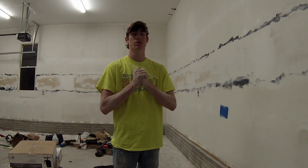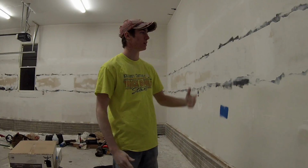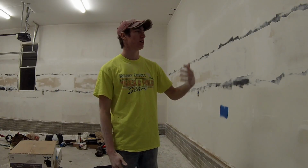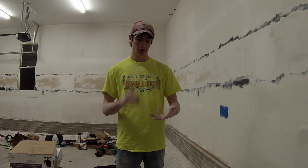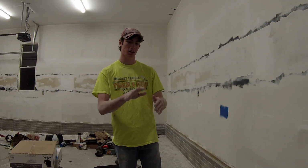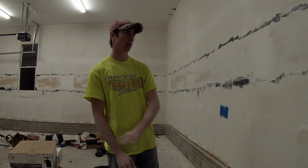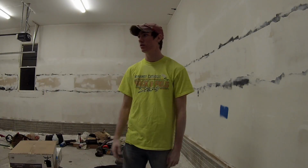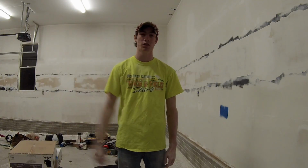So I didn't really want this video to be all about redoing it, because basically all I did was peel off as much as I could, and I didn't even need to do that. But basically, if this happens to you, I talked to 3 different people from Sherwin-Williams, Builders, and Menards, and they all said that you just sand the edges of the paint where there's a ridge. You sand that down as smooth as you can, and you come over with joint compound, go over all the cracks. So obviously I used a ton of joint compound. I had to buy another 3.5 gallon thing of it, and I used maybe a quarter of it, but that's alright. I'll use that for something else.